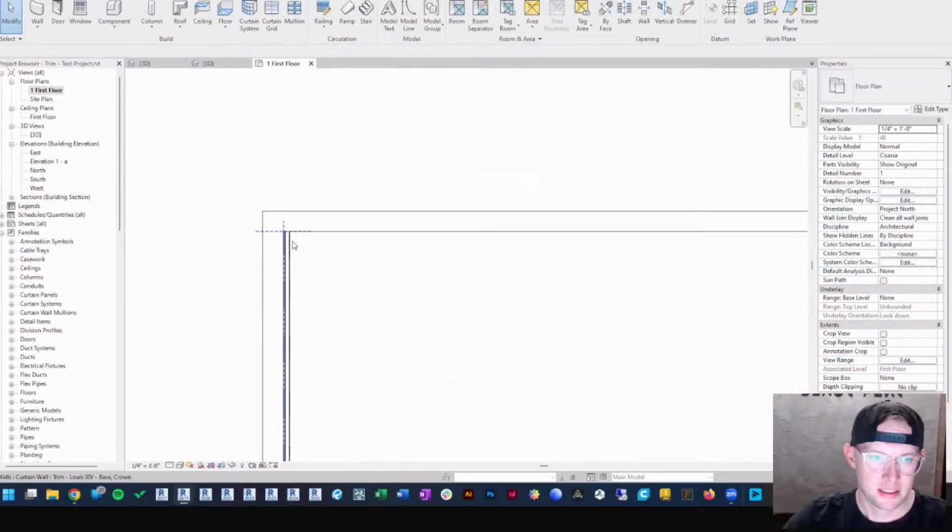One thing that somebody asked in the chat, which I was also walking through when I was playing with them, is the joining of curtain wall to adjacent walls. So when you placed it there, technically it's joined with the perpendicular wall, which means if you create one on the corner, they're not joining each other. You have to sort of pull them away. Is that the workflow you're thinking, place them all and then join them together, or have you played with anything?